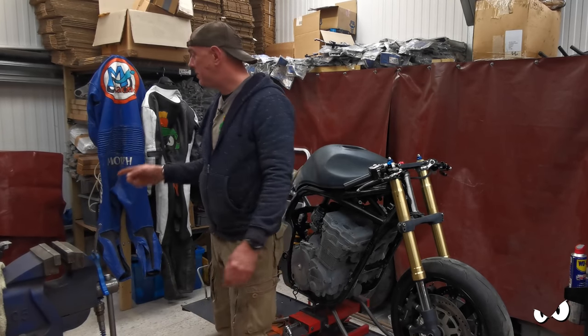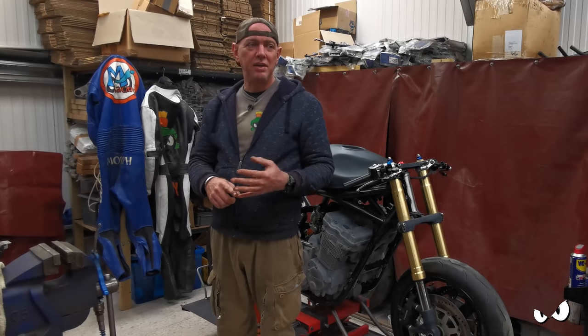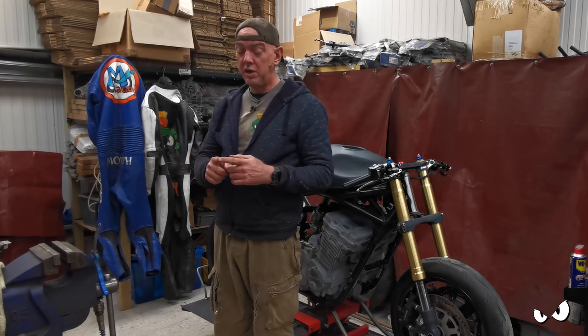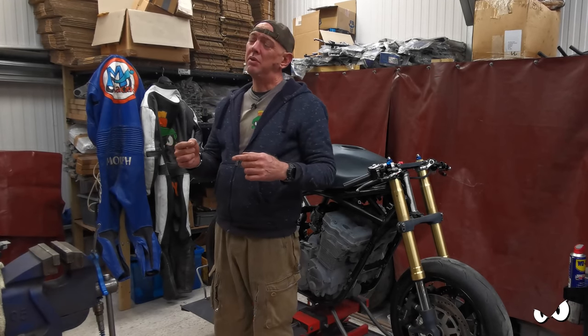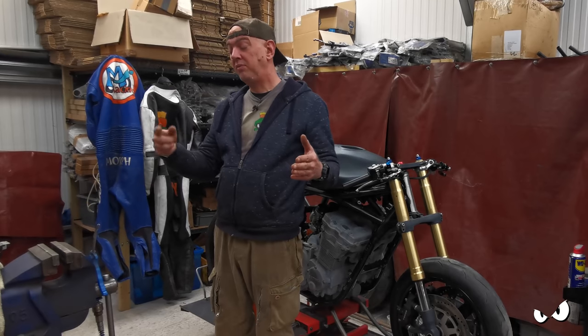There are a few other bits and pieces I'm still on the hunt for. I need to get a fixed steady rest. Basically, if what you're turning is three times longer than its diameter, it really needs to have some sort of support in there. I've got a live center, so that'll help. But if you've got a long something or other and you're trying to put a feature on the end of it, you really need a fixed steady rest.